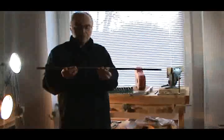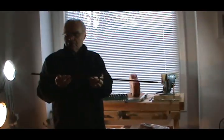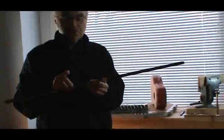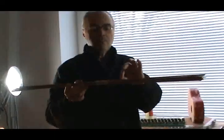Here's another, a little simpler one. Basically a piece of bocote that's about 30 inches long, about 2.5 millimeters or 3/32 of an inch thick, and about 1/4 of an inch high or 6.5 millimeters high. And here's some banding that was created using offcuts of bocote and laminate with 2 pieces of 0.6 millimeter 20 thou maple veneer, which go around on the inside of the ukulele. That's called purfling. The stuff that goes around the outside is called the banding.